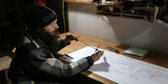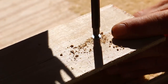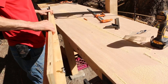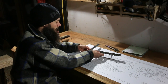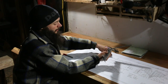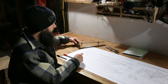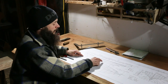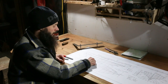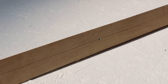We used a wire to snap the baseline and then erected our vertical station points using trammel points - these handy little guys that just screw on. We made a plywood I-beam that was three or four feet long and you use that to swing arcs. You put it on a point on the baseline, swing it out to make an arc, go over and do it again, and where those arcs intersect is exactly 90 degrees - between half the distance between two trammel points.